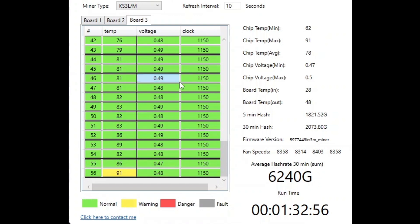That's telling me, without actually seeing the chips, that maybe my chips were running hot. I've got a Fruition Designs kit on this thing cranked up and I'm still seeing a warning on one of my chips — on Board 3, chip number 56, the temperature is 91°C. That's with cool ambient temperatures, so that's telling me I need to repaste this thing.